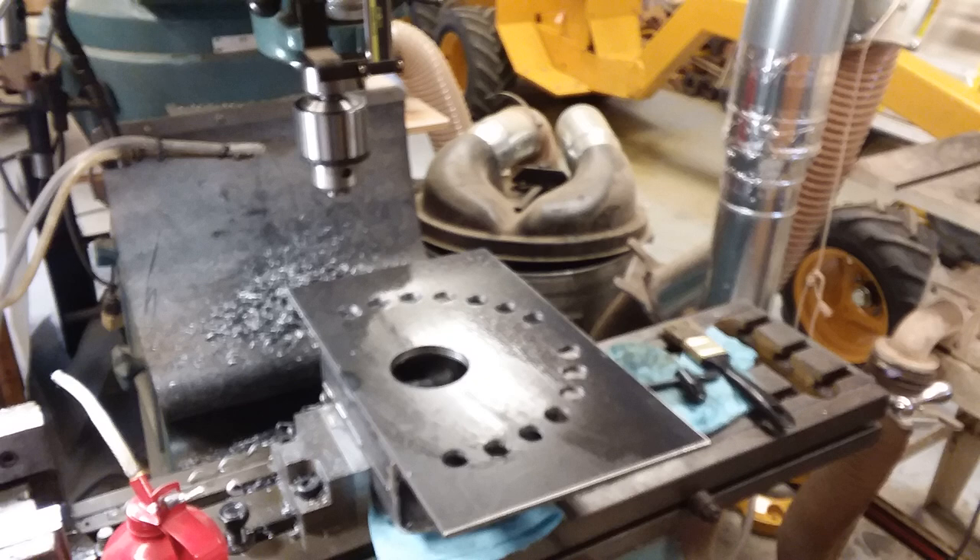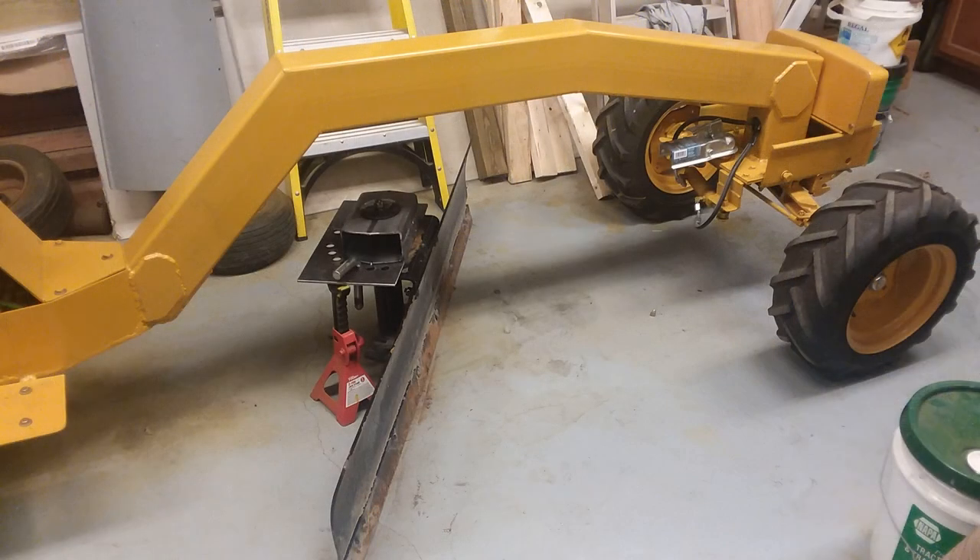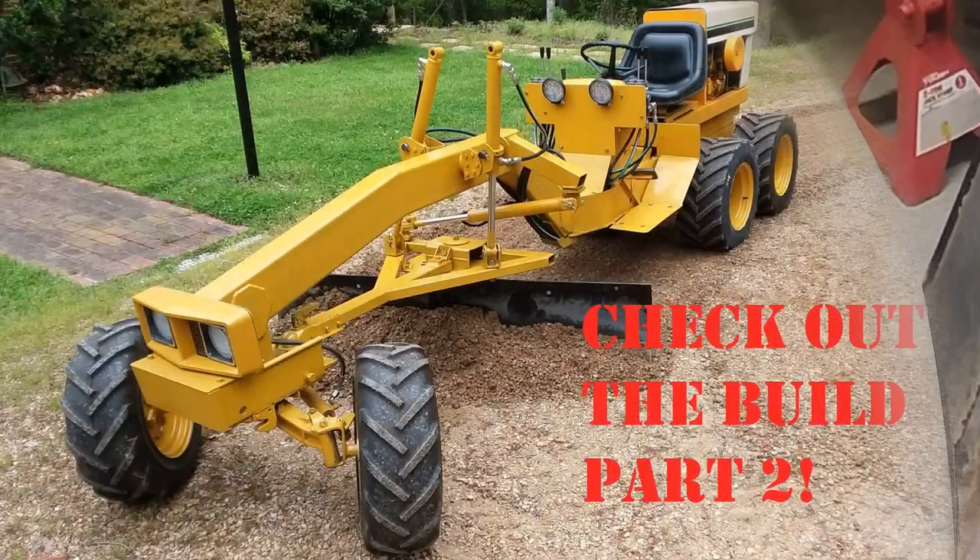This is the plate which attaches to the traction frame. The plate that was attached to the blade mates up with the holes on here so the pin locks the plate. You can see the moldboard with the plate that was just drilled, and that rectangular piece of steel tubing with the hole drilled through the middle supports the post. Those two plates are then attached to the traction frame.